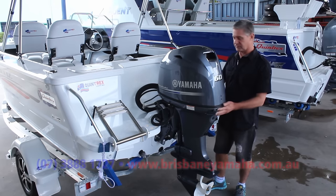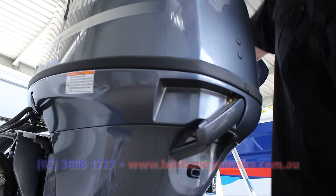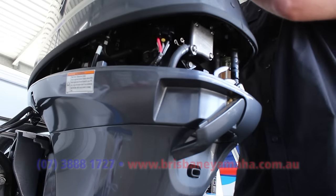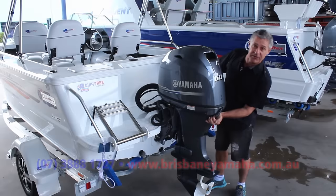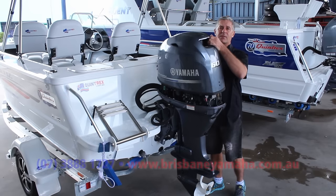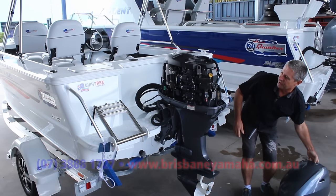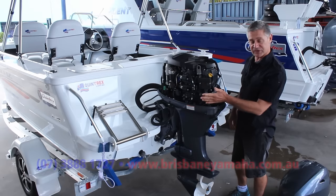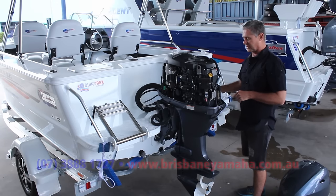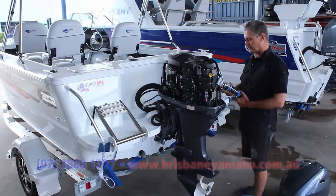This gives it a good film between the two. Even simple things like if you've never taken the cowl off before — know where the latch is and know you've got to tip it forward to get the hook at the back. The other advantage of this too is that by giving it a spray, you get to see what your engine actually looks like — in this case the four-stroke — where you add the oil, where your spark plugs are, where all the metal parts are. So it gives you a good understanding of the motor before you even get out on the water.